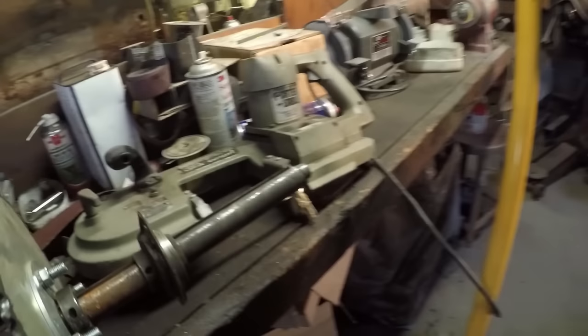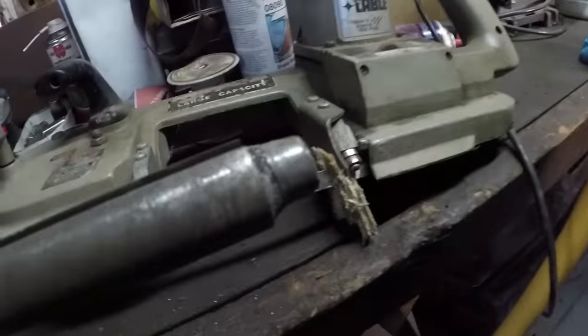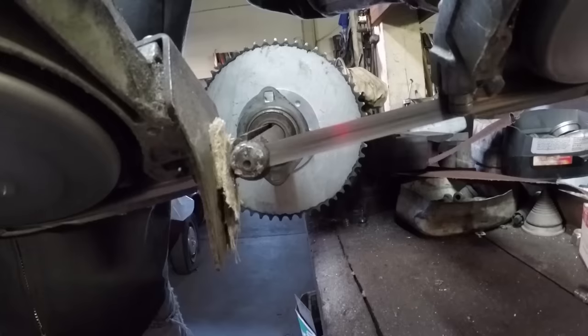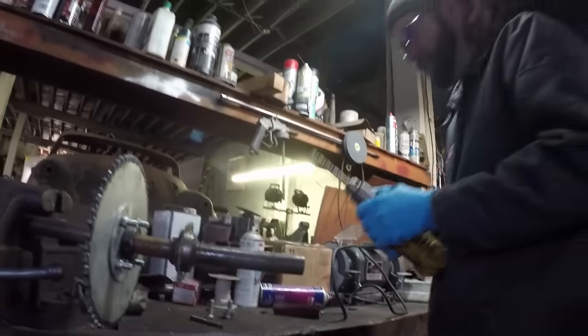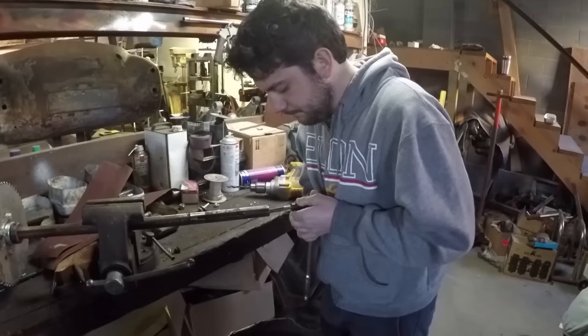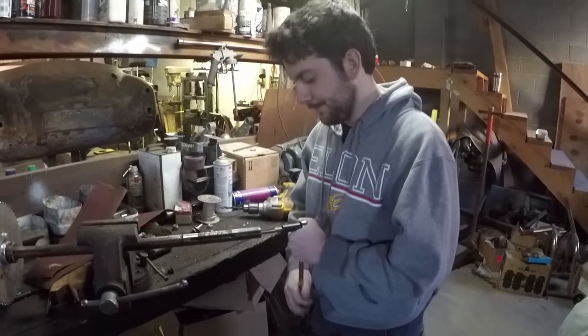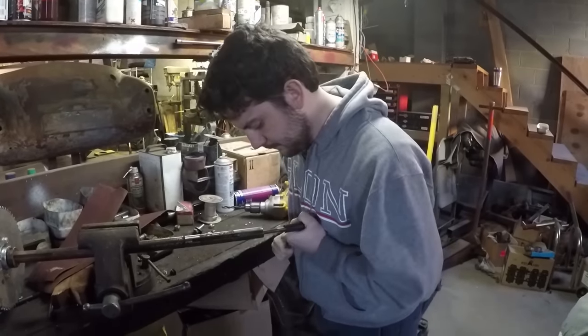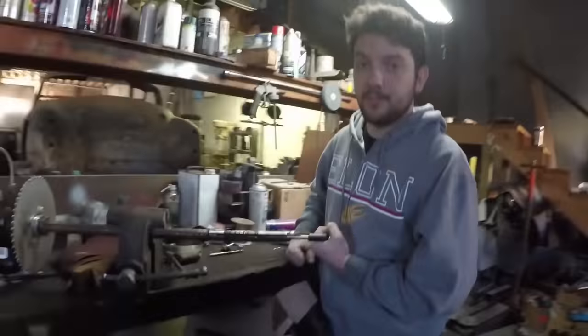We are here at Ike's work, cutting off the damaged ends of the axle — it just had a little bit too much rust, and when we took the nuts off, it took the threads with it. And no, they weren't reverse threads. We're going to cut off the ends, and we're going to drill and tap the axle. I am currently tapping this hole — hopefully not messing it up. We're doing this so we can put some bolts in the end to keep the wheels from falling off.